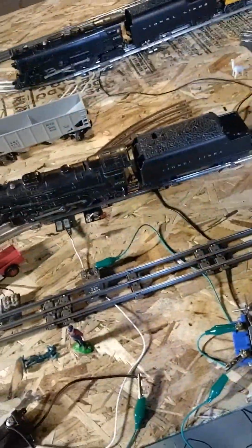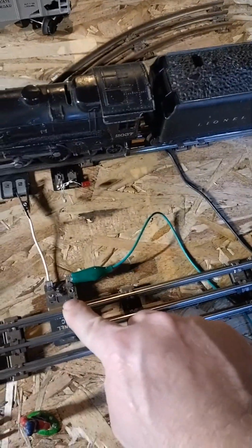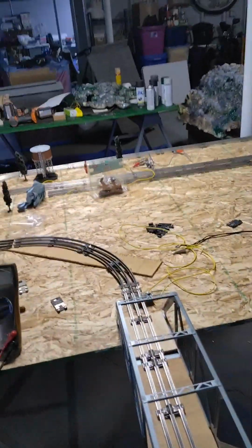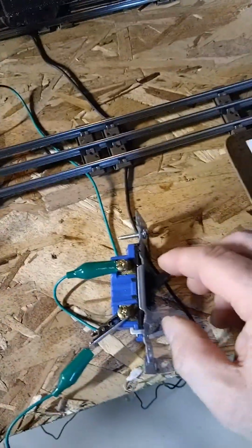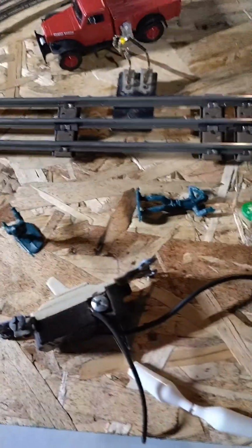So what I did to reconnect those is use power from the main track, which will still power up via this yellow LED, or there's another green LED down there. It's hard to see. I think I got something in the way. But then I did that by using a simple on-off light switch. Then I went here and I used a three-way light switch for two positions.